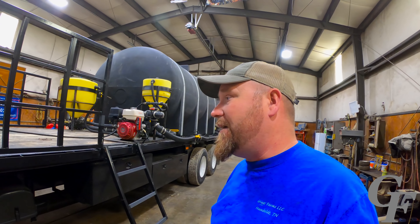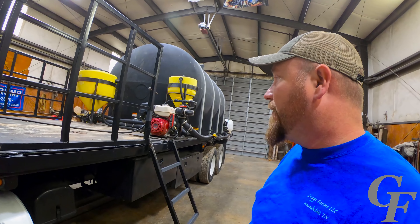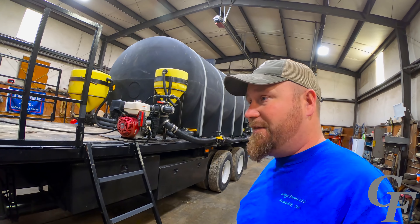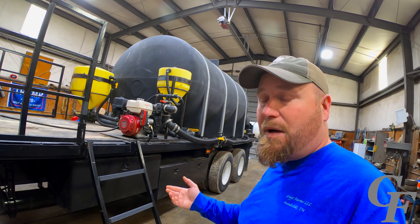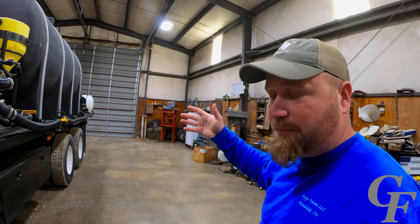When we're spraying things like liquid fertilizer, there can easily be another 25 gallons or so of liquid fertilizer still in the lines. If we disconnect from the sprayer with the lines full, we're going to lose a good bit of fertilizer, which we don't want to do. So when we're filling up with fertilizer and the tank on the sprayer is filled up to about 975 gallons, we'll open up the air valve and flush air through the lines to push all that extra fertilizer up into the tank and completely fill it up.